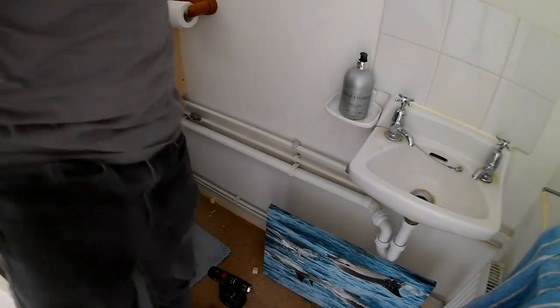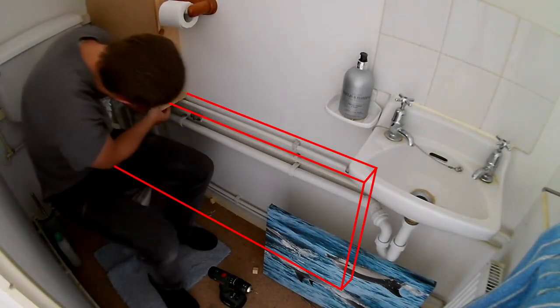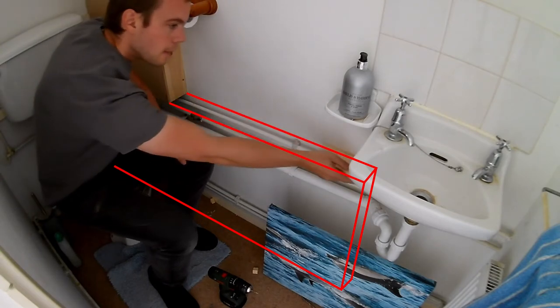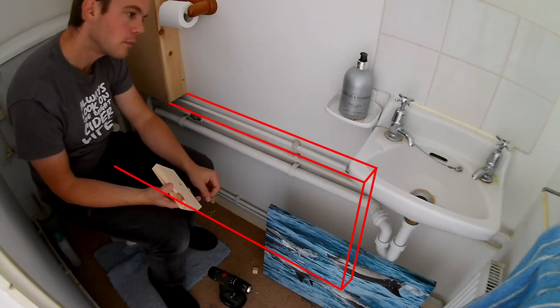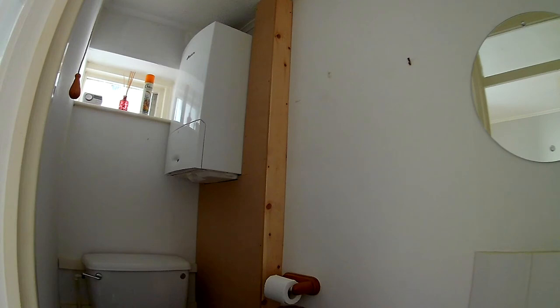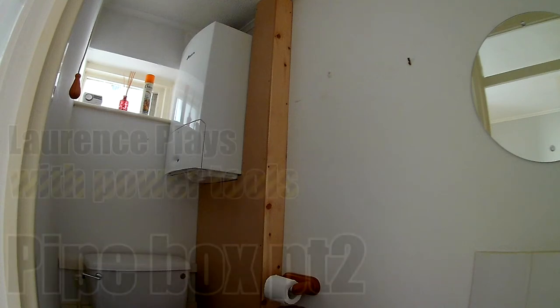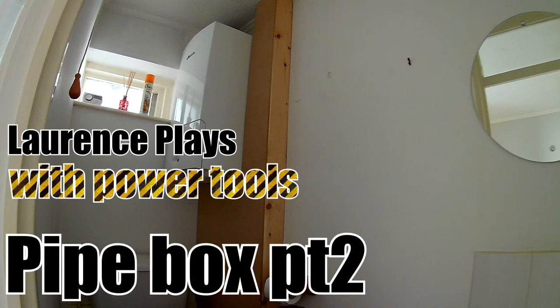The next stage, which we'll probably have to wait until we've had the basin replaced, is to build another box to run along the bottom, essentially from the back corner up to the basin. I'm going to wait to do that until I know exactly how big to make it, but it should be quite straightforward — I'll run a plank along above the pipe and have a piece of MDF attached to the front, with support blocks at floor level. Once that's all complete, I plan to put some filler in between the box and the wall for a nice finish and then paint the entire room, including the boxing. If access to the boiler is required, I can remove the front screws and take the front board off without disturbing the filler. I hope you've enjoyed this insight into my most recent DIY project. I'll carry on making videos as I do more work and I hope you'll come back for those. Thank you for watching and I'll see you next time.